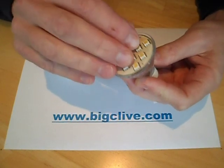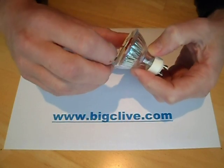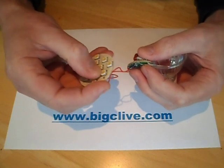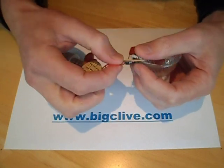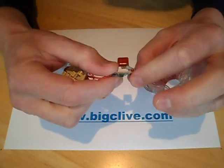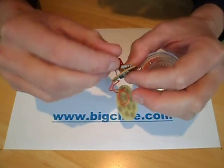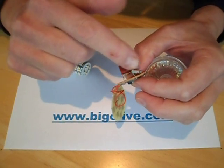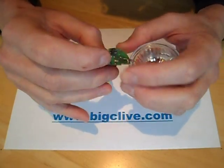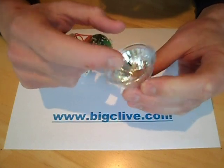You don't really want to touch this one while you're plugging it in because it doesn't have a plastic cover over the front. When you open it up, you see that the only thing between you and the mains — there are lots of exposed solder joints in the front here — is a capacitive dropper. It's a typical capacitive dropper: the limiting capacitor, the discharge resistor, the main limiting resistor to prevent inrush current, and a little rectifier in the back, all just gunked into this metallized interior reflector.